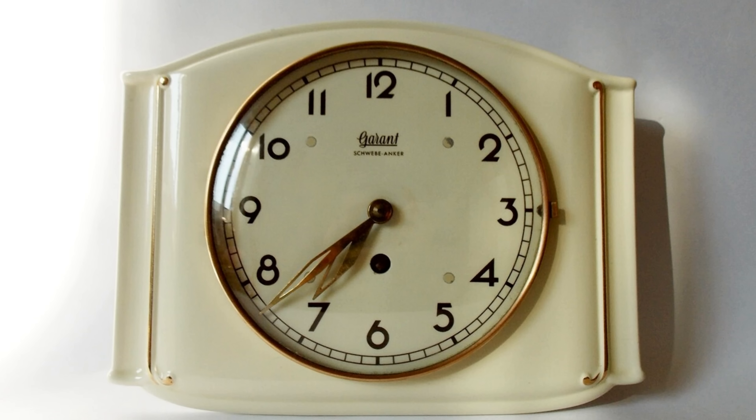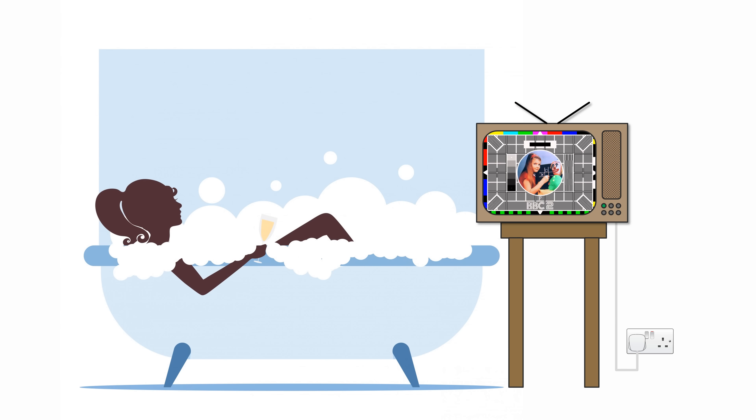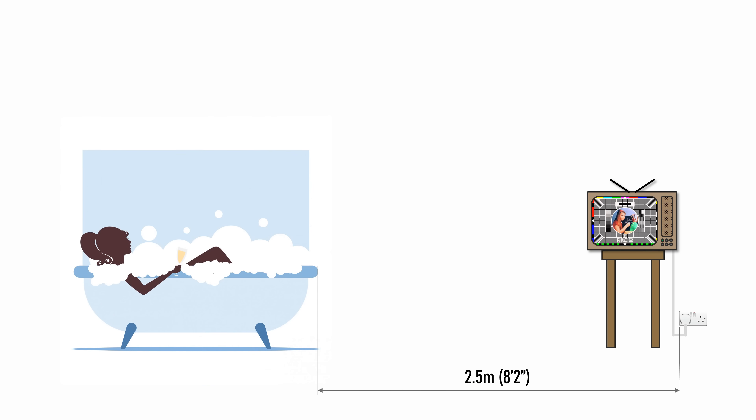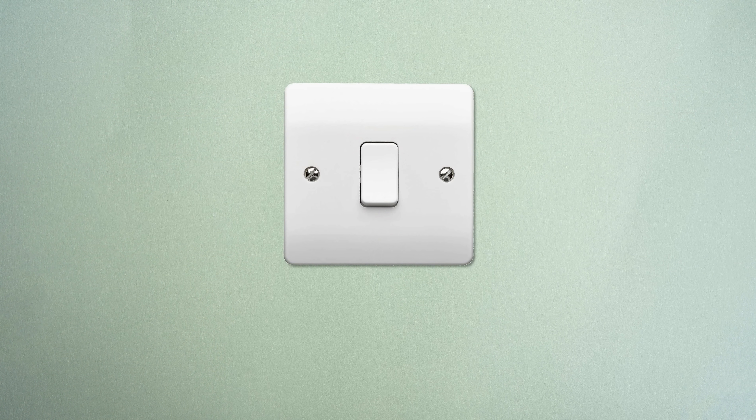There were two additional plug socket combinations that were also defined at the time. At a time when clocks were commonly plugged in, a low amperage and low profile clock connector was specified, and was sometimes installed over the mantelpiece. Having 230V 15-amp devices in the bathroom next to you in the bath is a recipe for disaster, which is why British rules state that sockets installed in a bathroom need to be at least 2.5 metres away from a bath or a shower. Not many people have bathrooms that big, which is why you don't often see regular sockets in bathrooms. This worry of touching a large current with wet hands also extends to light switches – the switch has to sufficiently isolate you from an electrical shock, so you commonly see pull cords extending from the ceiling. Many UK homes ignore the problem completely by putting the switch outside the bathroom, although this means it's easy for someone to come along and turn the light off accidentally while you're in the shower, providing another lovely injury opportunity.